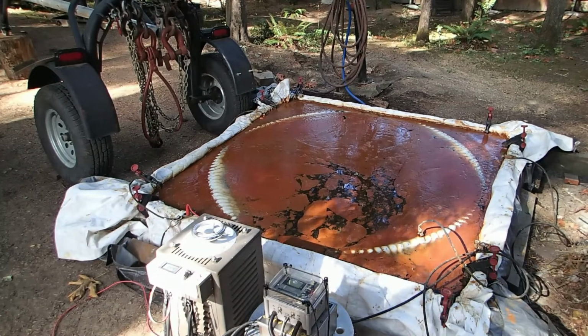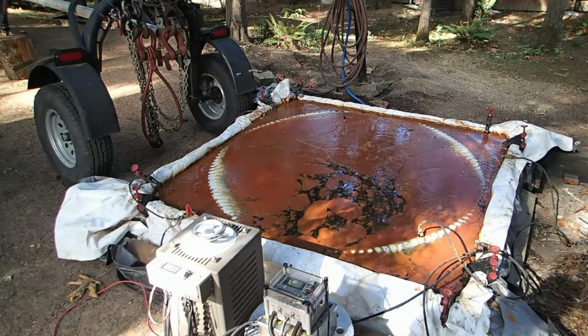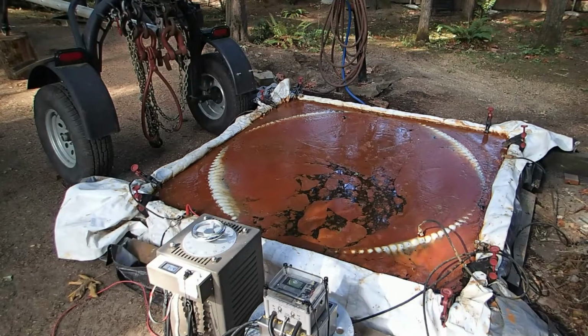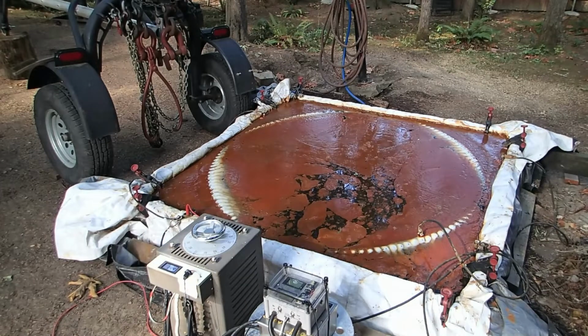So you can see the wind hasn't been too great, and she's foamed up pretty good. You can definitely see where the anodes are affecting the gear face by the wonderful foamy texturing. And I'm just going to put some cross pieces in so I can get the inside of the spokes some electrolytic action.